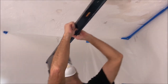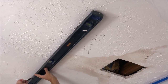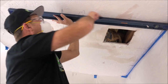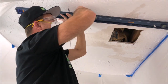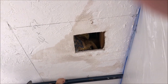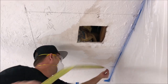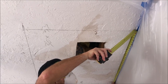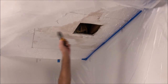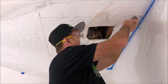Just like connecting the dots. When I'm straight on I can see better — there's a marked curve, so I'm just going to compensate. That will be my final measurement: 32 and a half inches. What I'm going to have to do is use a razor knife to cut where the furring strips are because I cannot use the keyhole saw there. Hopefully there's no screws or nails in that area — it'll dull the blade.